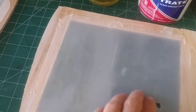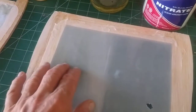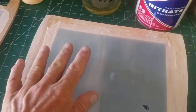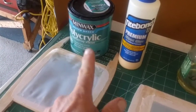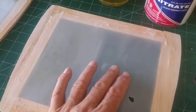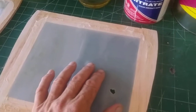This is the poly finish, and this almost feels like it's finished. But I know I'd have to put another two, possibly three more coats on just to fill the weave. Whereas the polycrylic filled it almost the first time. I would go from brushing that on to maybe lightly spraying another coat on.